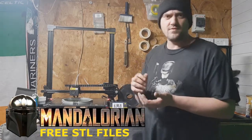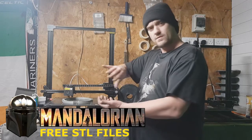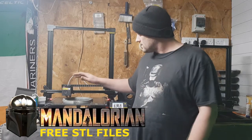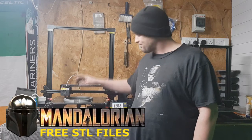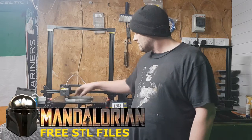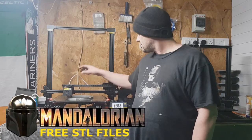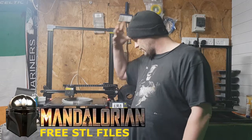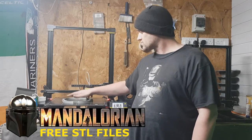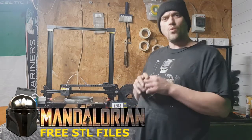What I've done is I've sliced the helmet in half. The bottom of the helmet I've flipped upside down in the Cura settings. And then when it comes to printing, it prints the helmet with no supports in the middle whatsoever, so you're not wasting any filament. And then when I come to print the second part — the dome, the top of the helmet — that's just got a little support in the middle. You're not wasting supports, you're not wasting material.